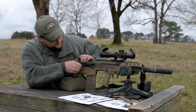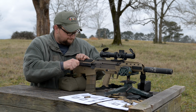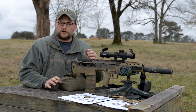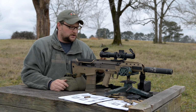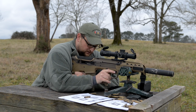We'll see if the brass is less damaged, but also see if maybe it'll lock to the rear like it should. So for this experiment, we're gonna pull off the port cover and we're gonna inspect the brass. Also, we wanna see where it throws the brass when the port cover's off, but we also wanna see if the bolt will lock to the rear. Okay, 25 more rounds.